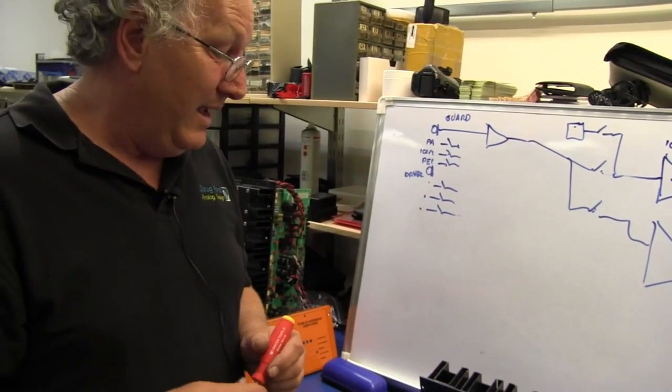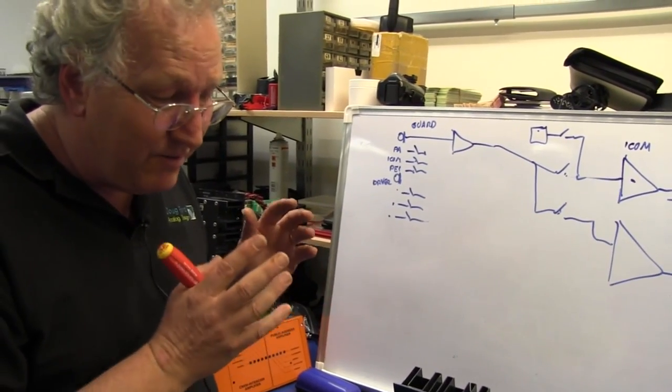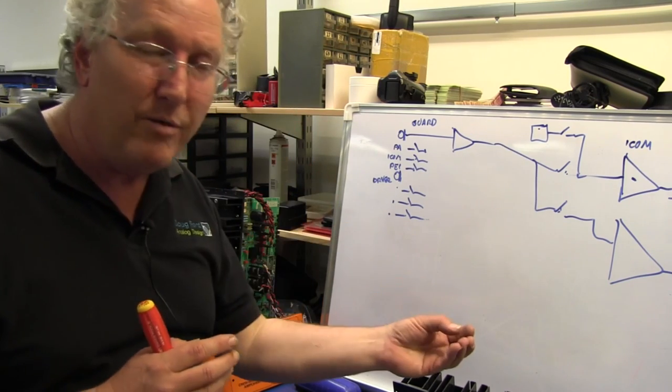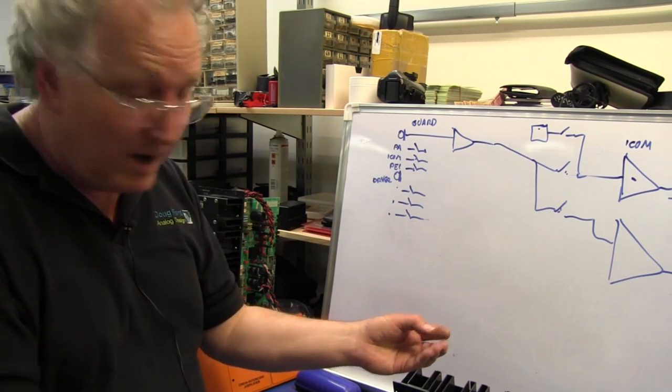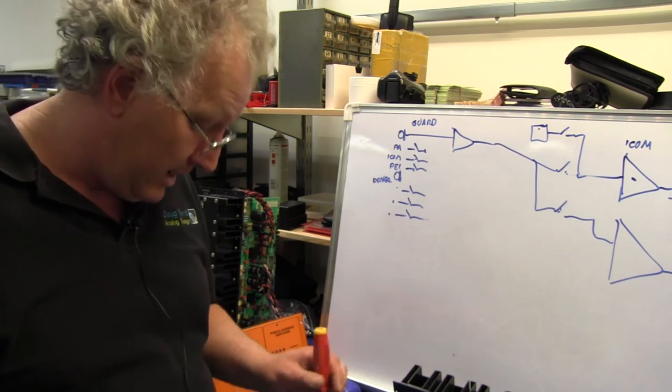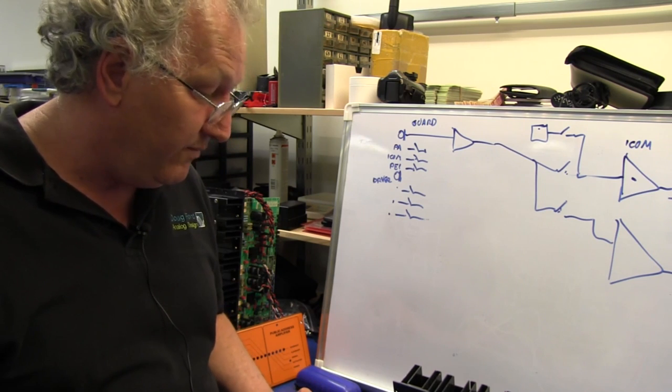It was a better trade-off. Yep, exactly. And particularly given that we weren't entirely sure about the relative reliability of relay on PCB versus socketed relay, we opted to go socketed relay. Just go for the socket. Yep. Right. And yeah, they've proven to be very reliable.